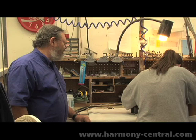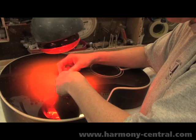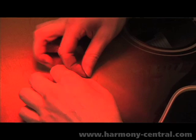In this case it's the open mustache four-bar bridge. Once the entire perimeter is hand cut, a relief cut across the pattern is generally done and the surface of the guitar top is warmed up with an infrared light, allowing that portion of the bridge finish to detach and come loose from the face of the guitar.